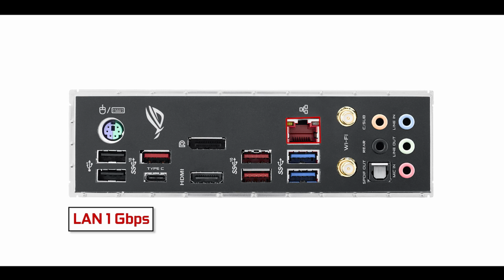We have a wireless adapter nested in there, which will allow motherboard manufacturers to more easily and more affordably add a Wi-Fi adapter without adding a dedicated third-party wireless chipset. So again, kudos. Not many improvements chipset-wise, but definitely good ones. Our surge protected gigabit LAN, and finally our usual 5-channel plus optical output.